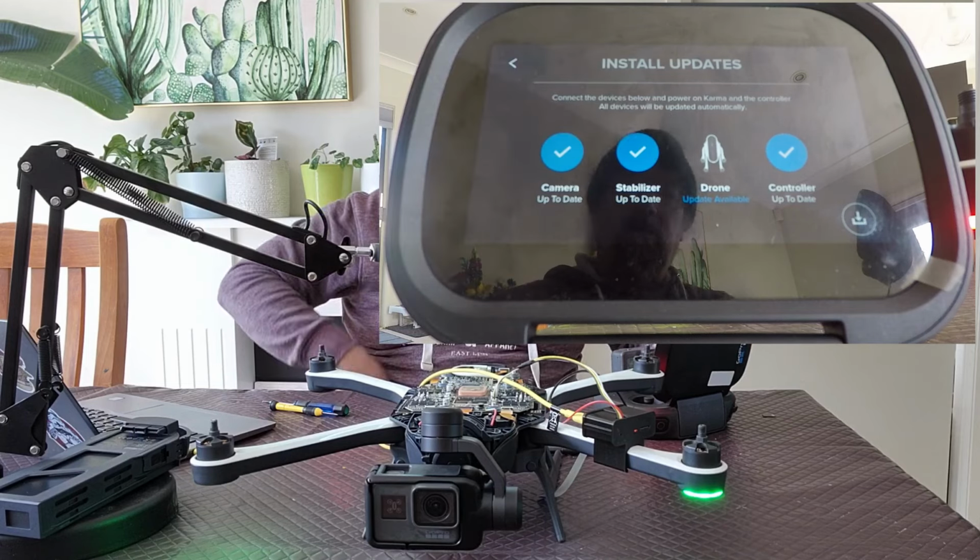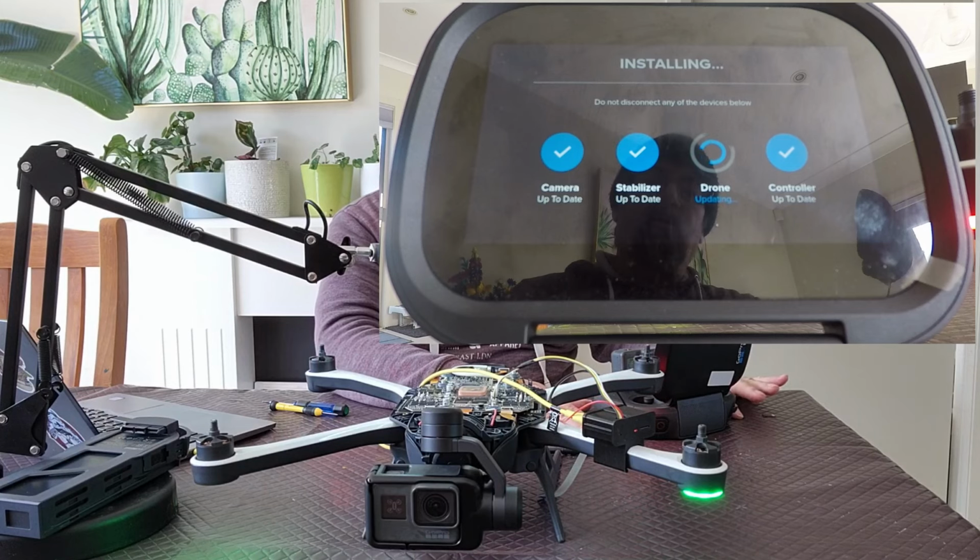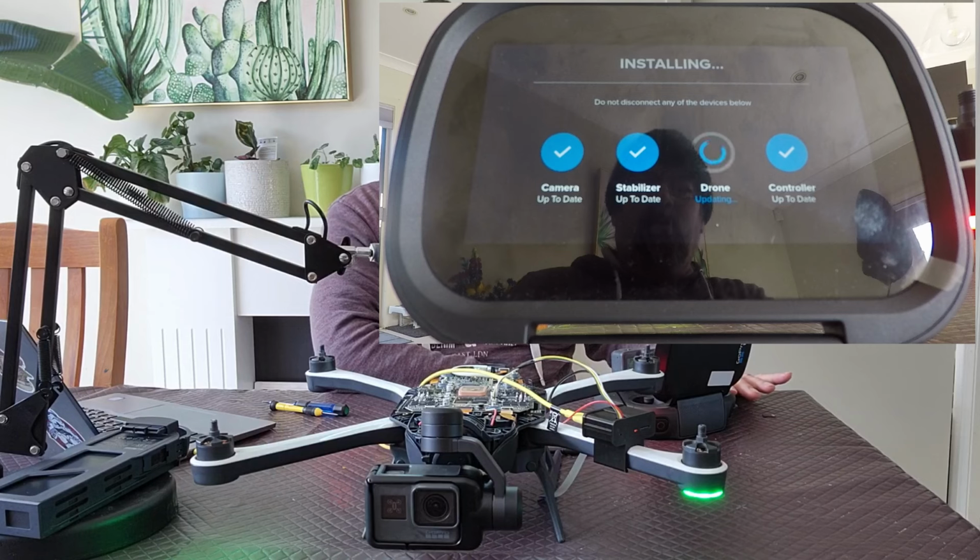So I want to update that. The controller is already at 2.50.1, which means it already has the software to update the drone. If the controller was at an older version, say 2.50 or 2, I would need to upgrade the controller's firmware first. There's a separate video on that. I'll drop a link in the description to it.